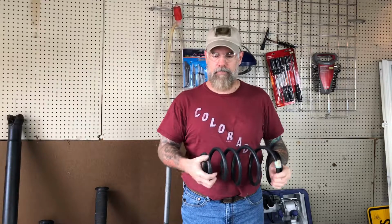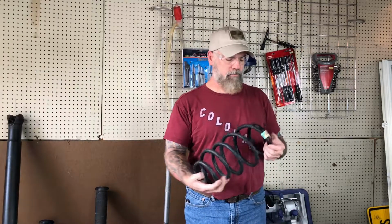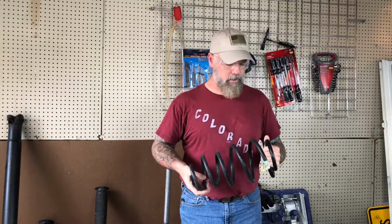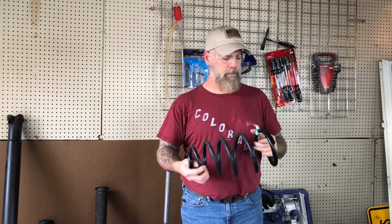And I think, based on some of the research that I was doing, that it's because I'm using a low carbon steel, which has a higher melting point and therefore a higher forge welding temperature that it needs to get to before it'll go. Spring steel is high carbon steel and can be hardened and is good for doing all kinds of tool stuff and hardening steel.